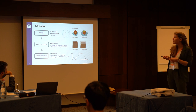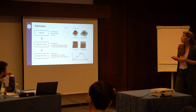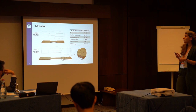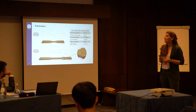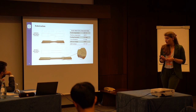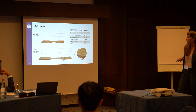After the printing phase, in our case we outsourced the debinding and sintering to an external company. But here you have a schematic showing the treatment that the specimens undergo. We started with simple shapes, and the printing process was pretty demanding, but finally we were able to create both fatigue and tensile specimens according to ASTM standards. Here I show the main printing parameters that we used.